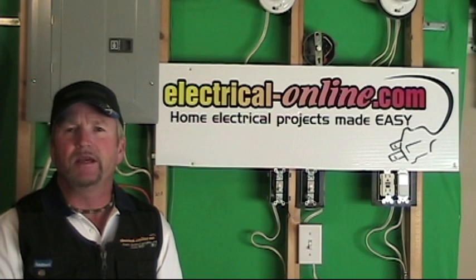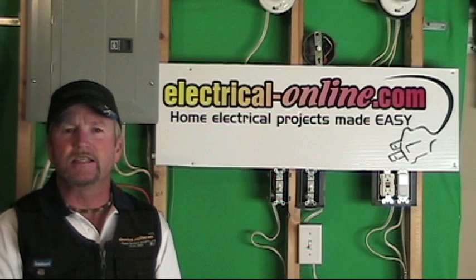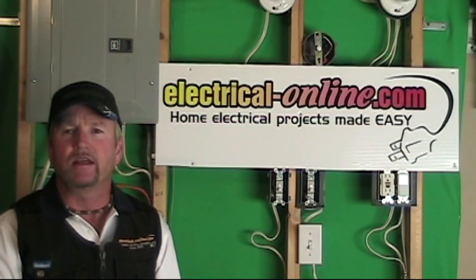Well, Stephen, the base of the lamp pole itself is an approved junction box for the termination of the underground cable and connection to the SJ cord that is pre-wired from the lantern heads on down to the base. When the fixtures get appropriate approval from accredited agencies, they approve the entire fixture as a whole, and a suitable location for the electrical connections is part of that inspection.